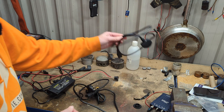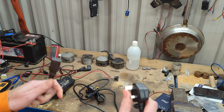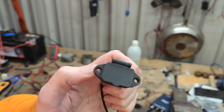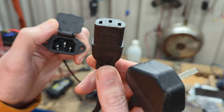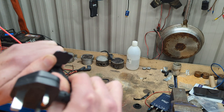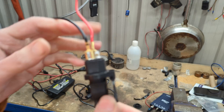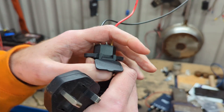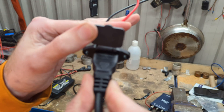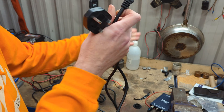The problem is the ability to get them mixed up if you are not a competent person. Not everyone can read, but we can all recognise shapes. If you were to see this plug shape in the back of your diesel heater and didn't know any better, you might take a mains plug and plug it in, then plug it into the wall and turn it on. At best it pops the fuse and murders the power supply with a loud bang. Worst case: it starts a fire and burns in a horrible mess, or it makes the diesel heater live at mains voltage resulting in possible electrocution and death.